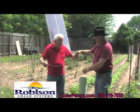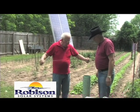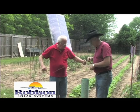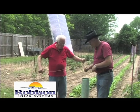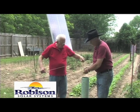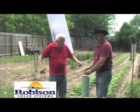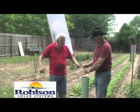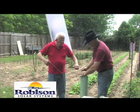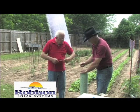Now what we're going to do — dad has got a weight fixed up on a string and we're going to let it down in the well. Go ahead and let it all the way down. You keep watching the bottom with a light, or here in daylight we can see this going down. It's actually touching the top of the water right now. What we'll do is tie a knot right here, and that tells me just about where the water line is. Then we go on down with the string until it bottoms out and there's slack in the line, and hopefully you'll have 20–25 feet of water.